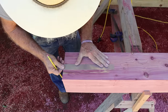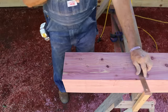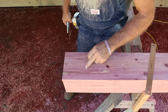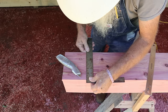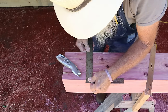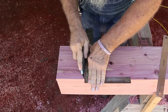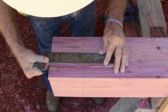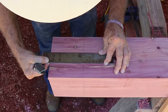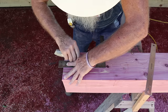I'm just going to make a line across there — that'll be what I cut. While I have this in position I'm going to go ahead and score this line all the way across and down. I've told you this before: I'm just barely covering the line when I make a score mark. I always score on the waste side — the part that's going to be cut off.